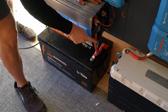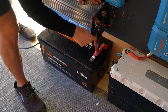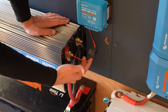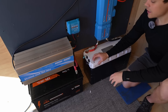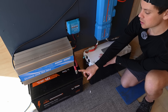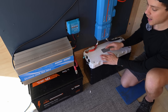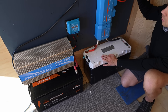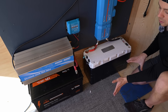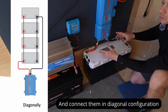With ready-made cables, you could build this system in a few minutes — throw the battery on the ground, screw the inverter and controller into the wall, then hook it all up with a screwdriver and a socket. Just ensure that you use the right size fuse and conductor for your solar charge controller. For these systems, we don't need an external fuse because the battery has one built in and the BMS has its own overcurrent protection. I recommend 2-gauge or 4-gauge cables. The distribution bus bar has a fuse for the solar charge controller, and the solar charge controller has a fuse built in as well. If you connect a third and fourth battery, use a bus bar on the wall and connect it to your system with a T-class fuse.